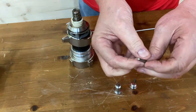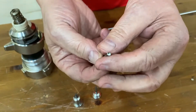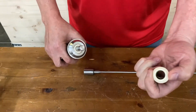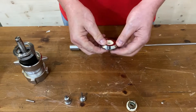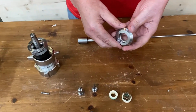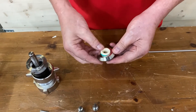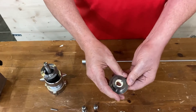If you notice, you can see three little notches on the end. That's the end that when you're putting it back together you push it in at this end, because this end is smooth. There's your pin. Now you want to change out the mechanical seal. You have two pieces to the mechanical seal: you have a rotating face, which is this piece, and then you have a stationary face, which is pressed into this seal washer. To change out the seal, you just push in from behind. Take that piece out, get your new seal. Once you're putting your new seal's stationary face back in, you notice there are notches. Inside there's a little tiny pin that you have to line up one of the notches with to keep this from spinning. So you put this in here, make sure it's lined up with a slot, then press it back in. It's lined up with the pin.